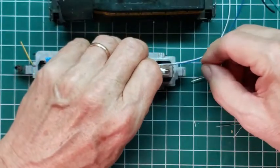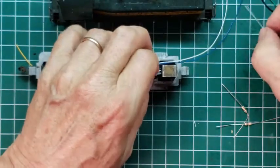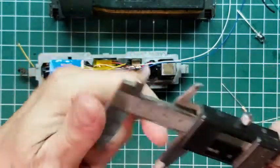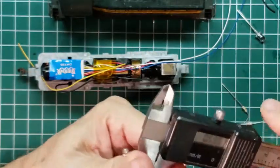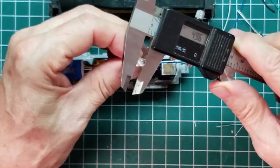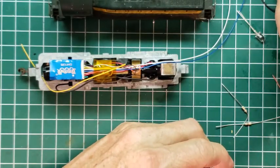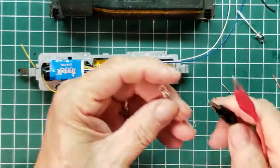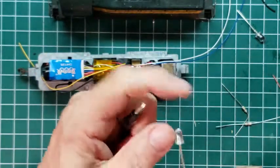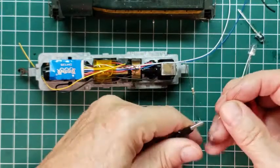If I'm going to put it in there like that, I can't really put it in that way because it's a 3, even though it's a 3 millimeter. It is a 3 millimeter, isn't it? I'm thinking it's larger than 3, so that would be 5. There's only two typical ones. I'm using the thing here. Oh, it's a 5mm. Well, no wonder. All right, let me check what this thing looks like under regular light. I really was going to put a 3mm in there. So again, plus on this side, we're going to do a 1000 ohm resistor. Well, I got 1000 ohm resistor right here. All right, grab this.